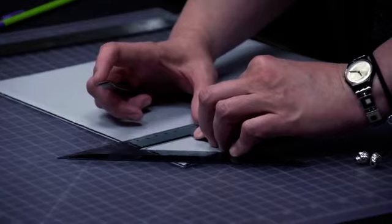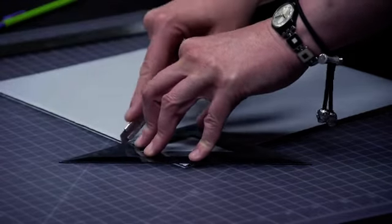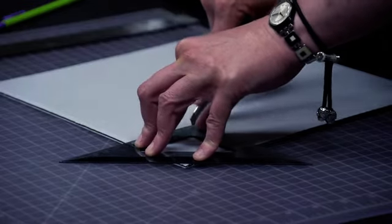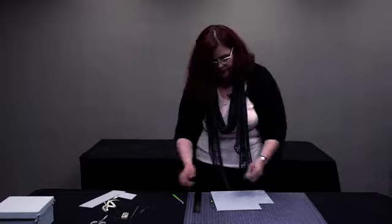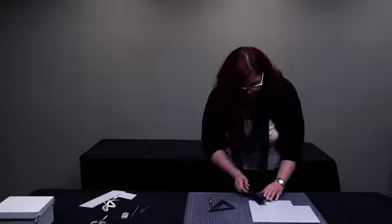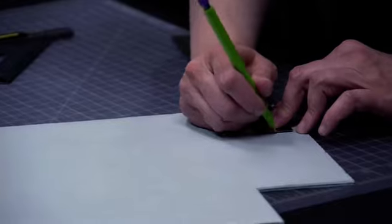Re-engineer that. Do the same thing. This box is really forgiving. So if I go a little past the edge of my triangle, the world isn't going to come to an end. And if I go half an inch past, it's probably a bigger problem, but just a tiny bit, no. And pull out my square. And I get to do that 3 more times. To be the most efficient, you would do all of the measuring first and then all of the cutting.